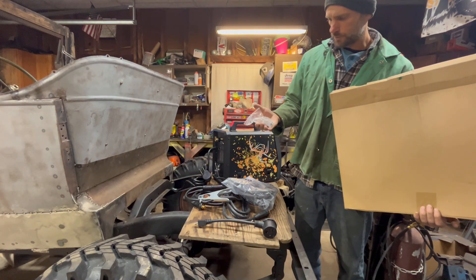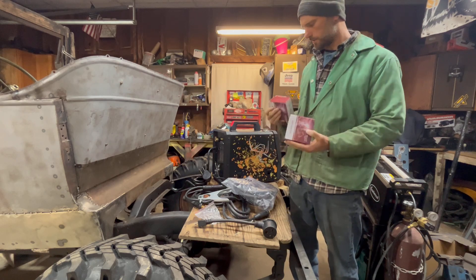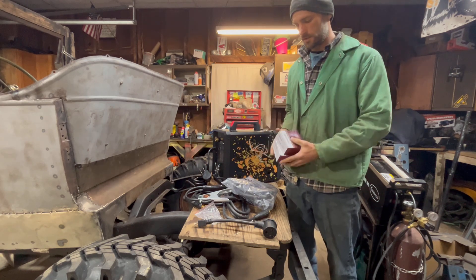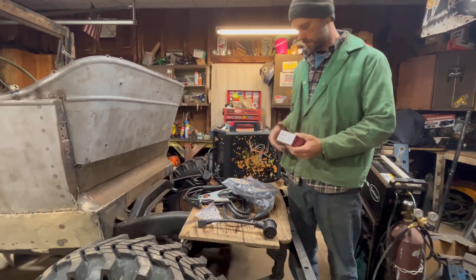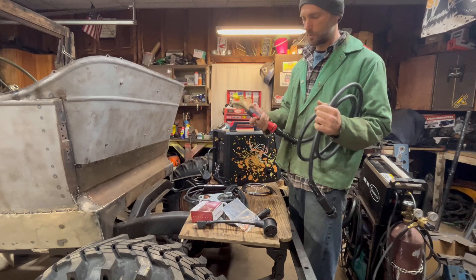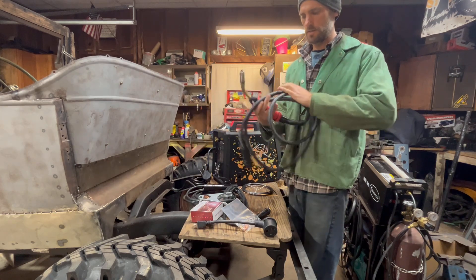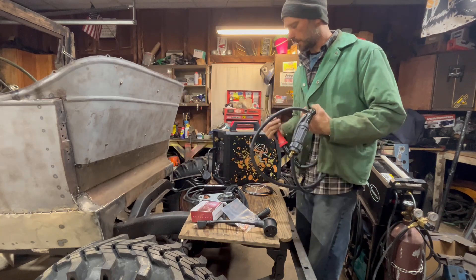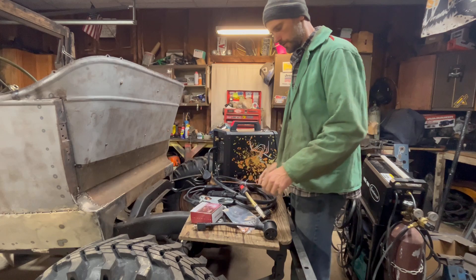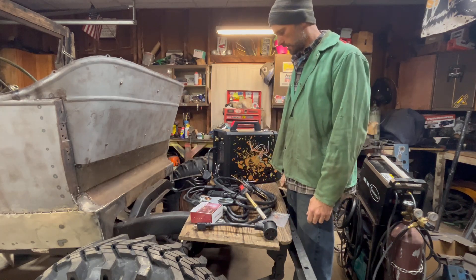Got a bag full of different size drive wheels. And two different spools of wire — we got a .030 and one is flux core, one is solid. I don't really do flux core welding around here, so I'll save that for emergency. Here's the MIG torch — nice and heavy, like heavy built, feels pretty good. It's got the flex ball on the handle for a little better movement. Definitely a robust plug. I do like that it comes with a spare liner, because at one point or another you're going to kink it or step on it or drive over it. And then a little baggie with four tips and a multi-tool for changing tips. Pretty complete package. Let's get it hooked up.